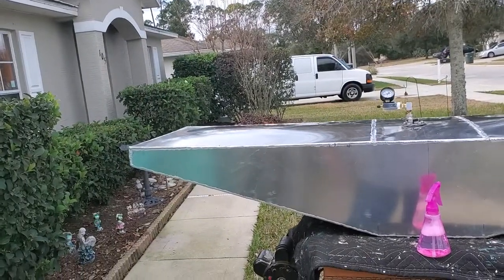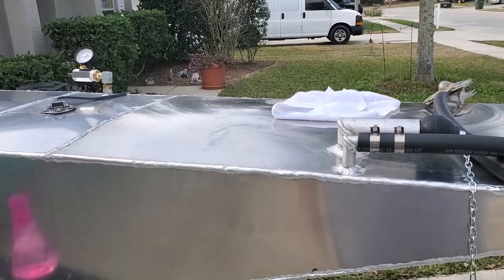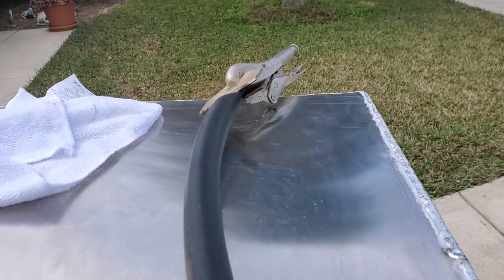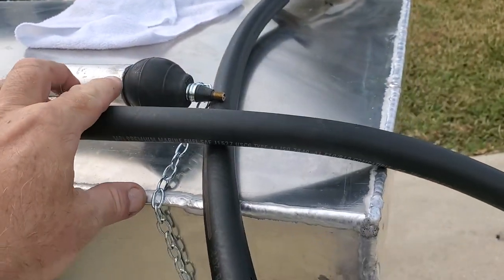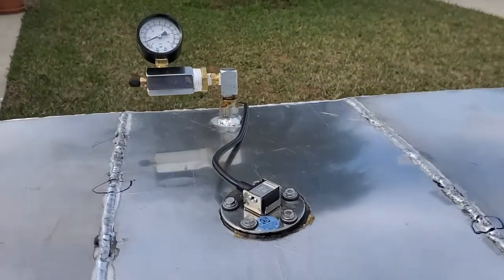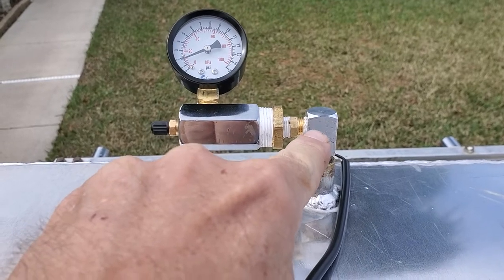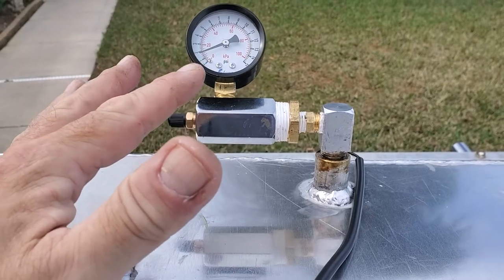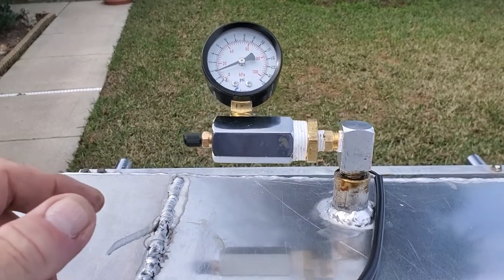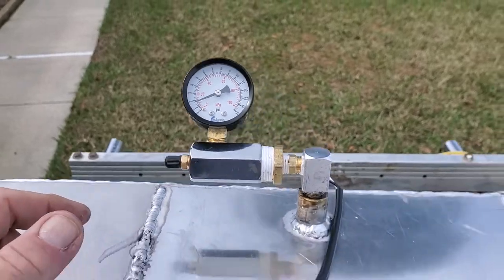In this episode we've got a little bit of a problem. I took the fuel tank out — it was custom made to fit — and I clamped the fill line with some vice grips. I used a J plug to block that end, installed the sender unit, and got a pressure fitting on the pickup line. When it's actually in use this whole assembly will be gone and a fuel line will just be tapped in and run to the engine. I've got just under two pounds of air in it and it's leaking.